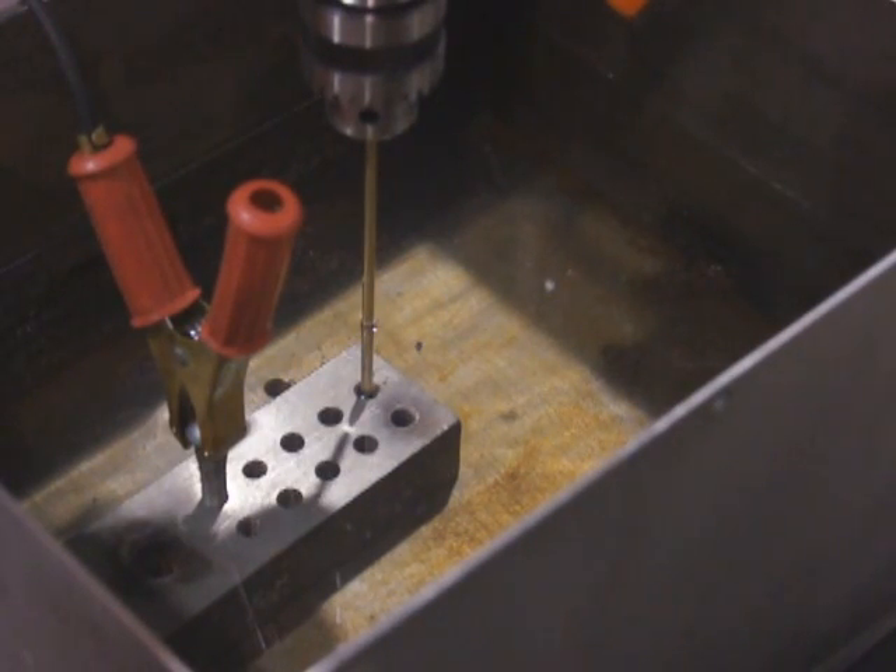The second method of flushing is completely submerging the spot where you're drilling. For small parts this is easy. For larger parts, you can use the chemical clay in the kit — they're all silicone — along with some other material you have laying around to build a dam around the workpiece. The biggest advantage of submerge flushing is it's not going to be quite as messy, and your cutting speed is going to be a little bit faster.